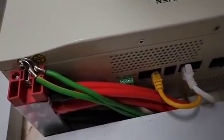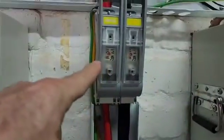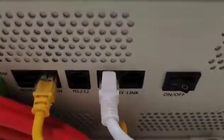We've doubled up with the 25mm cables to link — the 25mm² links and the 35mm² goes in here up to that switch there, which is a 160 amp blade fuse. Then it goes in there. We've got it earthed here and earthed here as well.